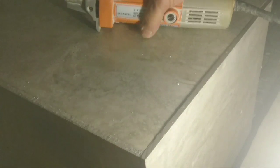Now, cooking with Crisco. And we're going to round this edge over. I'm going to cut straight across that edge. And I'm going to flatten it so it runs at like a 30-degree angle across there.